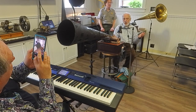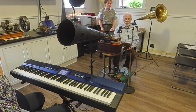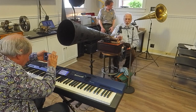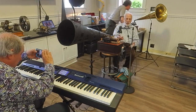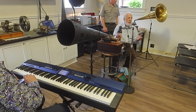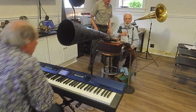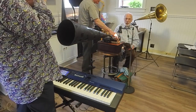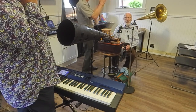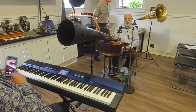Well, these machines have sufficient power, for one. And two, we use a little electronic device that basically reads out the RPM. Oh, okay. A little fancy high-tech thing off of Amazon. Right. So you can tell. And just take a cylinder and then you calibrate. Well, there's a lower-tech way of doing it with the strobe that's there as well. You shine the light on it, and it'll stand still if it's the right speed. That's how you set speed.